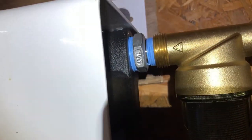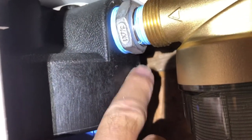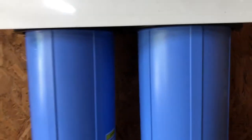I'm checking for leaks again, and so far it's dry. But there's a little leak — I can see some beads of water. I may have to depressurize again and give this just a tiny more snug. This one I think is dry. No, there are a few little beads there too. So I'll close the valves, depressurize through the drain, give these a tiny more snug, and just keep going until I finally get it leak-free.